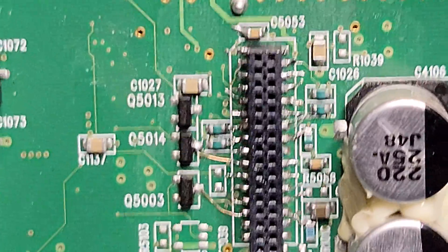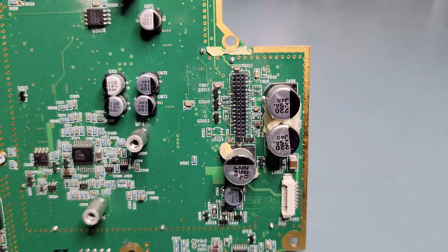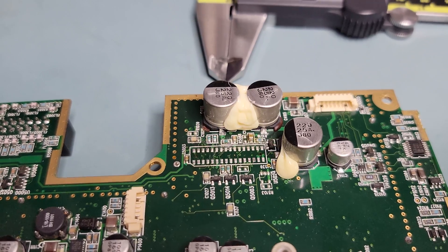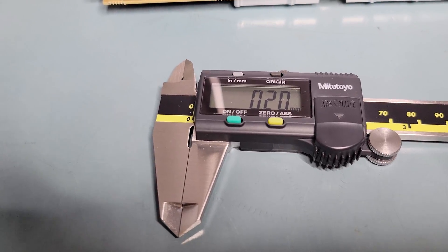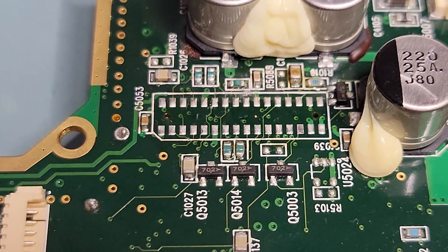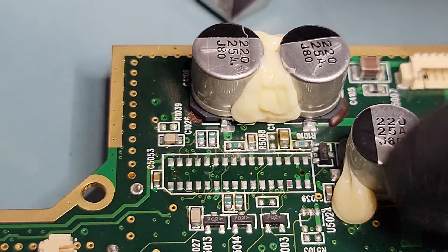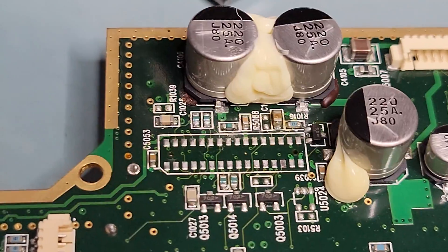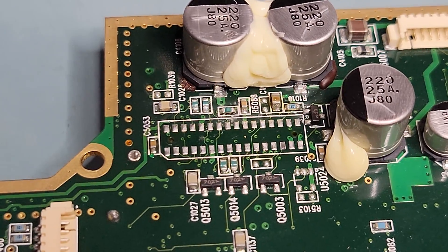You can see it's a pretty clean repair, and those traces are microscopic. To answer how small they are: I tried to freehand a measurement with calipers, and those traces are no wider than 0.2 millimeters. You can imagine how difficult it is to do pad strip restoration on this board, and as Alex noted in his video, you have these large aluminum electrolytic capacitors in the way — so when you're trying to get an iron into this area and reflow those joints, it's especially difficult. Thank you Alex, I know this was not an easy repair.